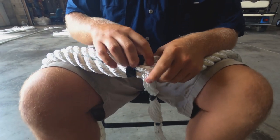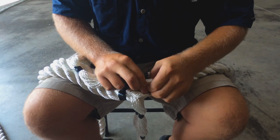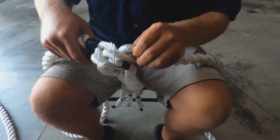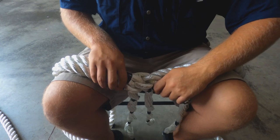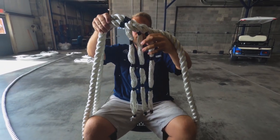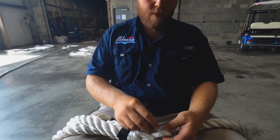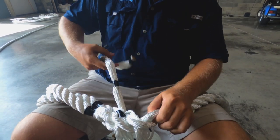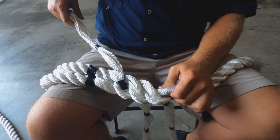So then we look at this line and we follow the braid as the next piece in the braid. We simply go through, pick open our next braid past this one, and filter this strand in. We'll get one more started — our third and final braid — go one more braid down and push it through. A good rule of thumb when you're splicing a line is if you're doing it right and following the braids, when you hold it up you'll see you have three strands — one, two, three — perfectly in line. Then it's just a system: you take the furthest back line, get one more braid up, pull it through, and you can get going pretty quick. You're just intertwining the braids into the line, which gives it strength over just using a knot.